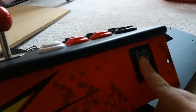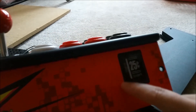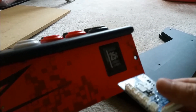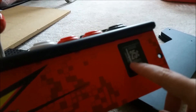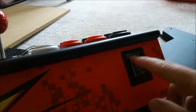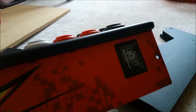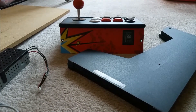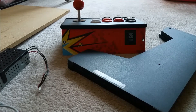Another thing I forgot to mention: I added some more LEDs. This little fake coin slot was basically a power indicator originally for the Bluetooth board that came with it. There was a single LED and it didn't really light up the whole thing, but there were spots on the PCB to add more LEDs, so I did that. I added a couple more red LEDs so this whole thing lights up pretty spectacularly now — really cool. I'm probably just going to keep that as a power indicator, and I might mount a momentary push button there to handle soft power for the Raspberry Pi.